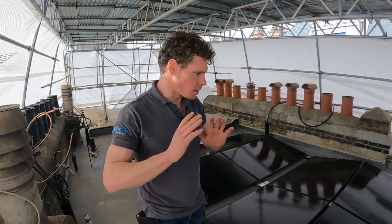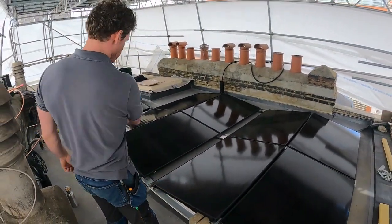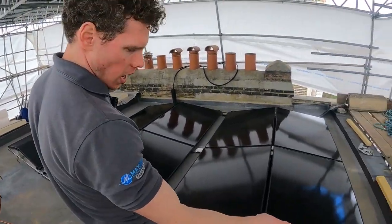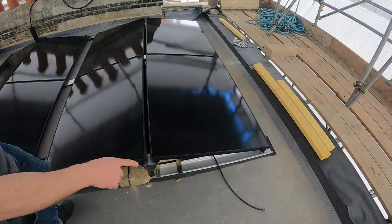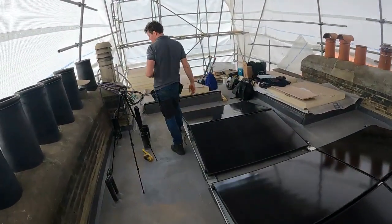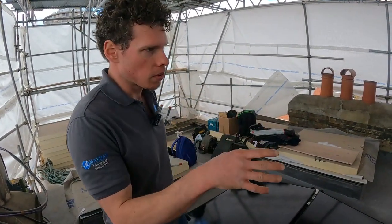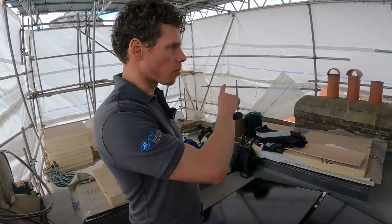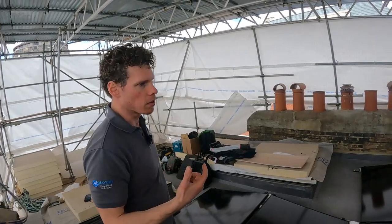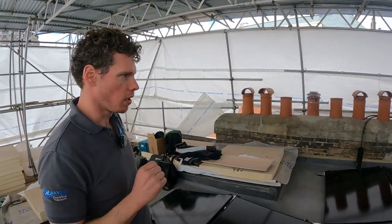This is the on-roof system installed from the roof perspective. We've mounted all the longitudinal rails and between each rail we've put a buffer guard on the asphalt roof. We've used a sacrificial layer below and put the ballast in. This cable here will get a little end cap, and on this side there's a 6mm three-core cable already run from the basement, so we're just going to jump onto that. One issue with this particular layout is quite a lot of shading coming in from the parapet walls — that's where the micro inverter system really comes into its own, as it can optimize each panel individually. Shading can bring down an entire string system, but it's much less of an issue here.